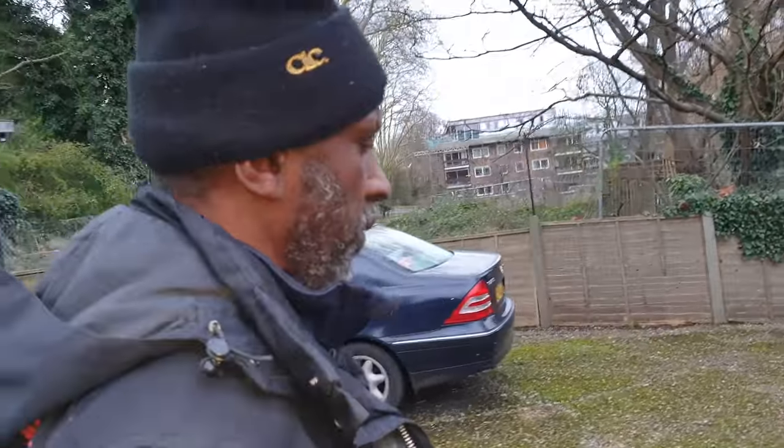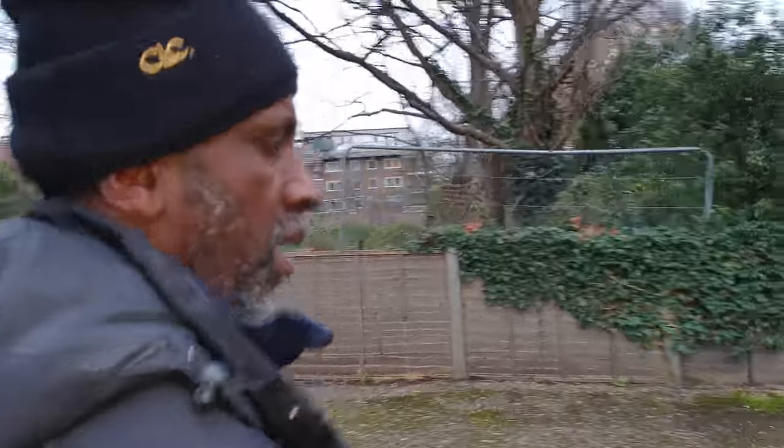All right, you can come down. So what I've done, I've put one, I don't know whether it's live and neutral, phase and neutral, down to earth. So when I go down here, whichever one gives me a reading to earth, that's what that will be. So then I'll just put a bit of sleeving on that to mark it. If it's phase, then I put sleeving on it. If it's neutral, I just leave it. I suppose you should put blue on it, to be correct.